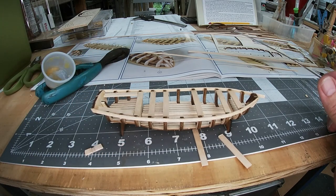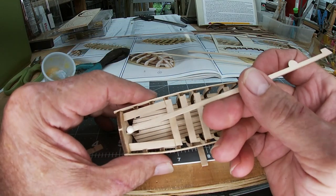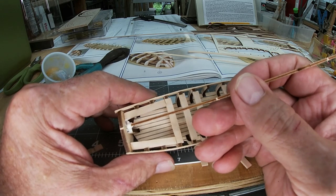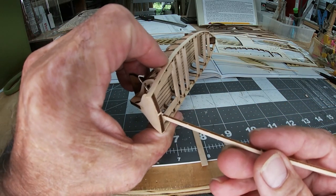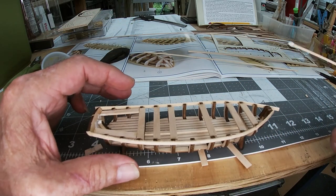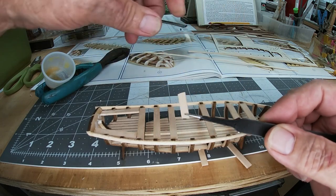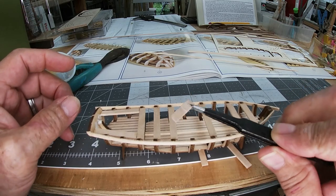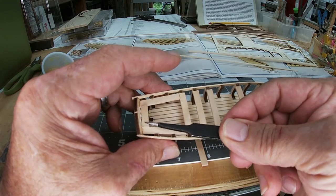and the stuffing they put in between the deck boards to seal them up. So I'm very carefully, one board at a time, assembling this, trying to get some glue along that back wall. You can see this piece. We had to chamfer the edges at a little bit of an angle and then notch out the back of it for that keel beam coming up in there.